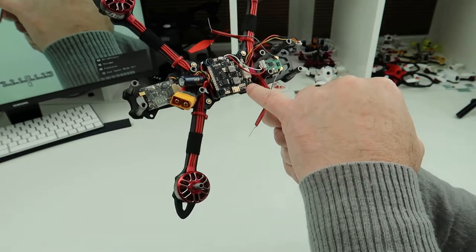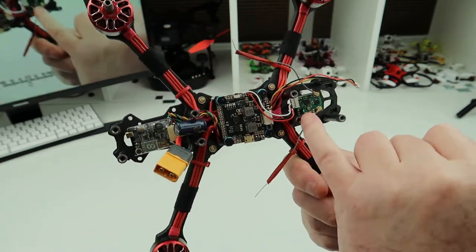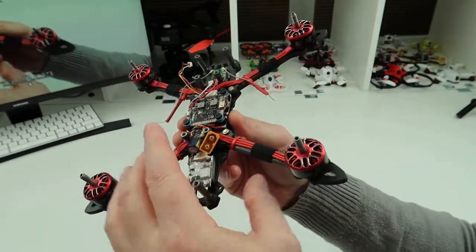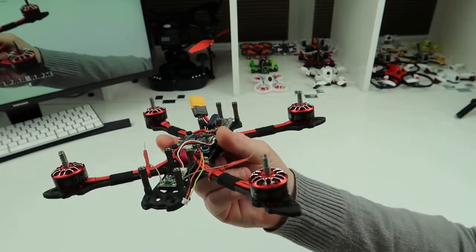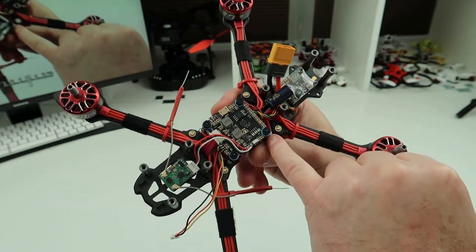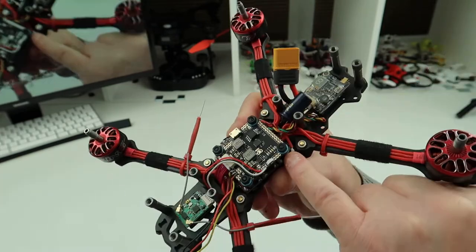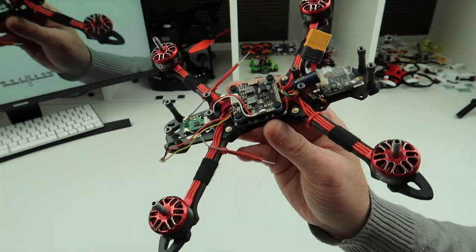We've now got it in the frame. The stack's gone on the top, and I've brought the wires underneath the stack to go to the VTX at the back. This is the receiver — this is a great frame because I can put the receiver in the front and bring the receiver wires back. I'm mounting the RunCam on the underside of the top plate, then put the camera in place, and it's just a matter of setting it up on Betaflight. One thing to mention: because this is quite a strange stack, I've had to re-solder the wires on the outer edges of the ESC due to the plastic spacers, but apart from that it's been a really easy build.